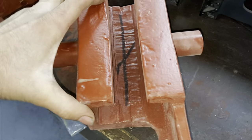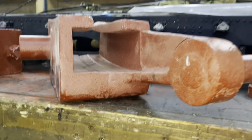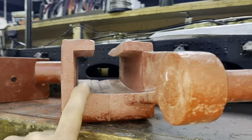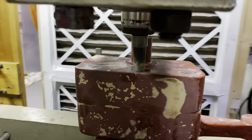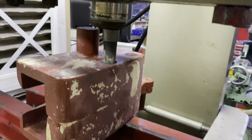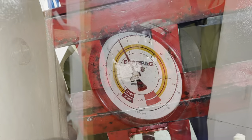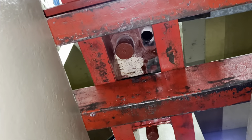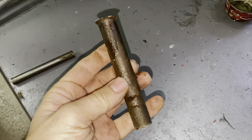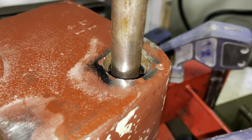A quick look at the actual expansion link — the slideways either side take a die block that slides up on either side. We had to split it apart so that we could machine those faces, because there's no way to get inside there otherwise. As you saw, pressing those pins out took quite a lot of force, because there's a countersunk shape in the hole itself and the pin was riveted in, spreading out and filling the countersink. So we just pressed them really hard until the countersunk riveting peeled off and they were able to push out.